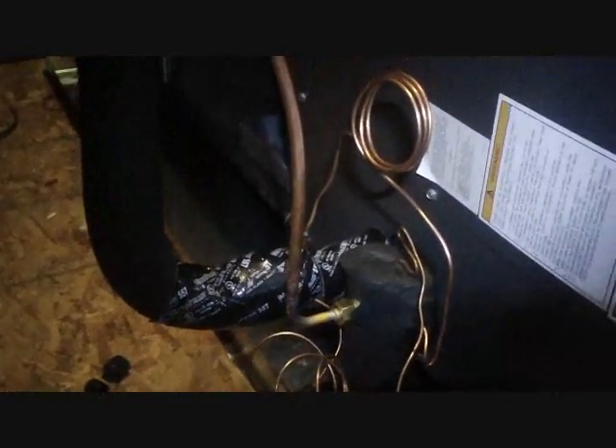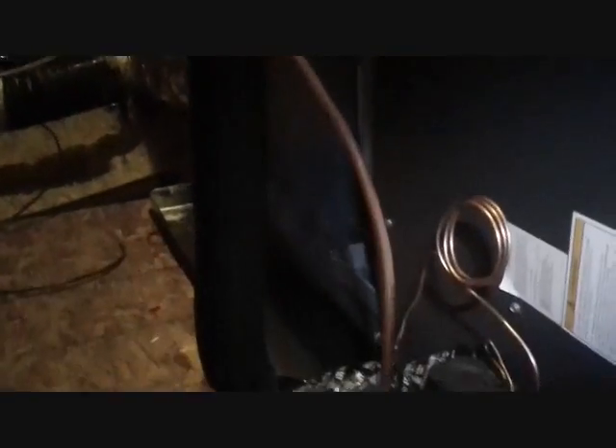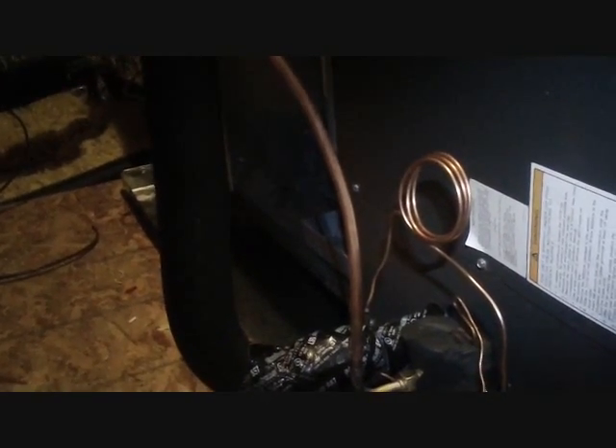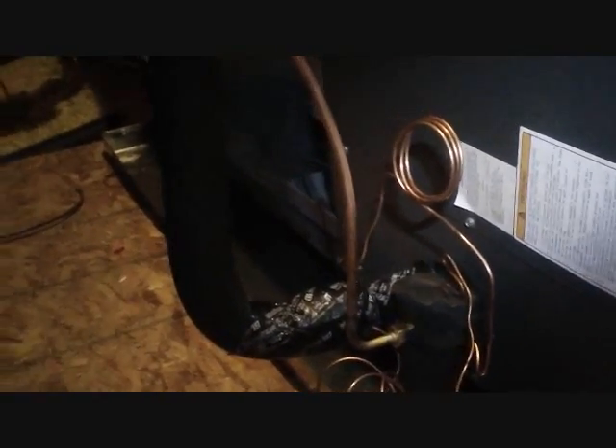We got our air handler set. We tied into the old duct work so they'll have AC for tonight, and tomorrow we'll come back and disconnect it and put in a new trunk line, and insulate this return duct. We have two ducts — one in the back, one on the top. Line set comes up, over, down, and into the air handler. Got a field-mount TXV to make it 15 SEER, with the bulb mounted at the 2 o'clock position as recommended by Emerson. Right now I'm doing the line voltage wiring and I'll be adding a freeze thermostat and line voltage controller on all my installations to prevent freezing, which I think is the worst problem with air handlers over the years.